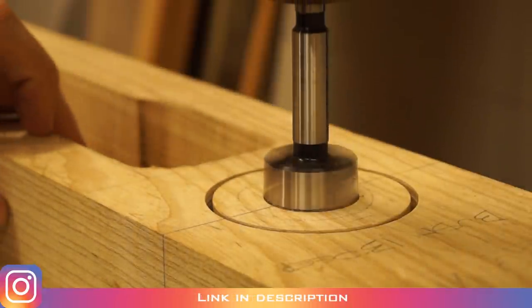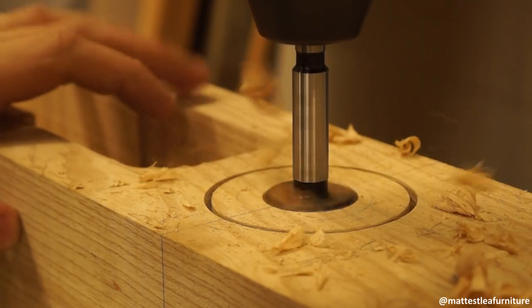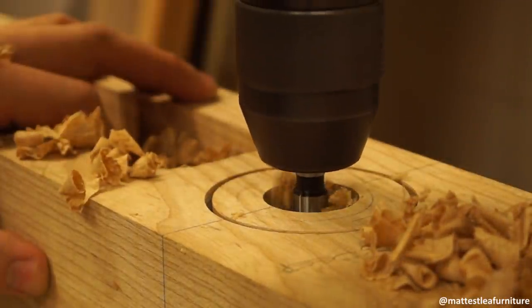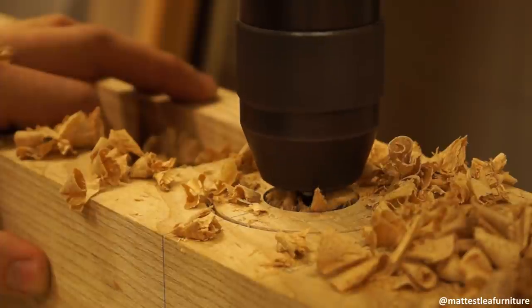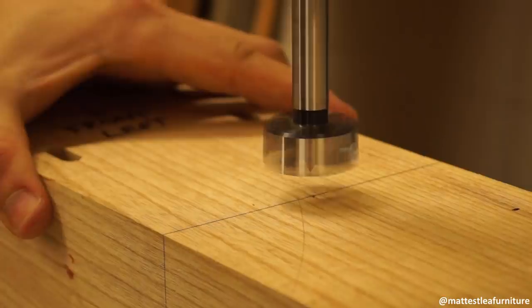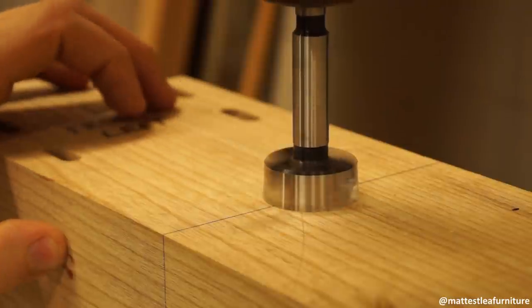So I had to drill down about an inch, then swap over to the hole saw, use that spur point in the middle to locate the pilot drill on the hole saw, and then go back into that pre-drilled hole as I am here, and the walls obviously give location to that without needing the spur in the middle to locate it. Difficult to explain, but this is the problem that I had when drilling out something in the other videos. I can't remember what it was.